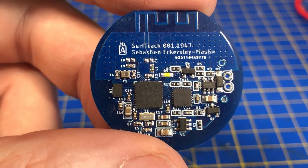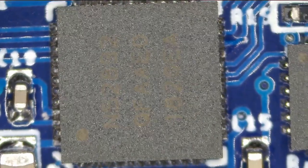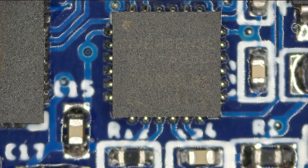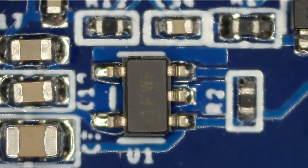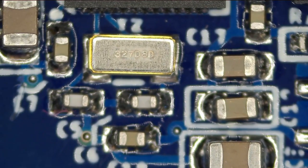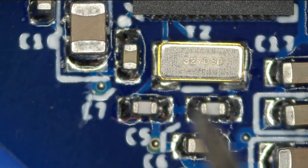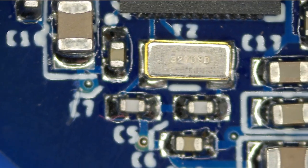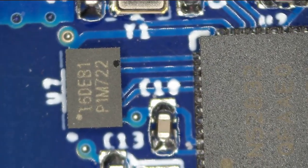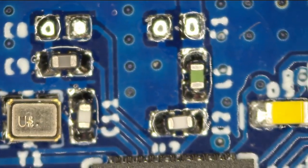Let's get a closer look under the microscope. We can see the main processor in the center here and the accelerometer to the right. What I want to check here is to make sure that the solder has reflowed correctly and there's no balling or bridges in the solder joints. The manufacturer I use is fairly reliable and I've never really had too many problems, but it always pays to check if you've got the equipment, particularly with sensitive components like the crystal where the solder joints are a little bit tricky. The memory chip is another interesting one because the actual legs of the chip are underneath the circuit. Unfortunately, without an x-ray machine, it's almost impossible to verify that's been done correctly. But it looks pretty square, so I'm happy with that.